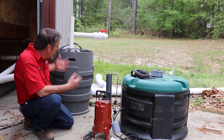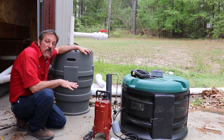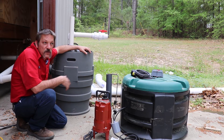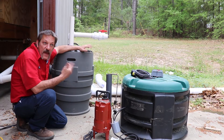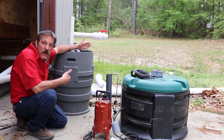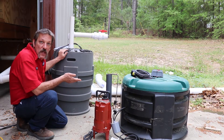While we're waiting on that, we're going to talk about what we've got here. This is the system that we use anytime our sewer exits a house, or say it's a basement house, and our sewer line comes out below the city's tap or without enough elevation to make it a gravity run — we have to pump it. These guys work great for a residential application.